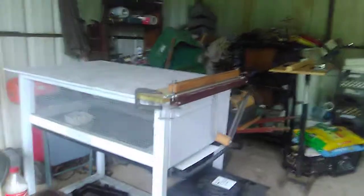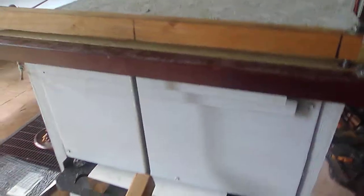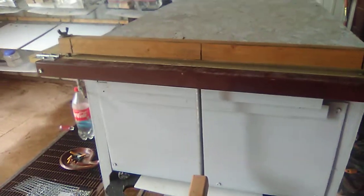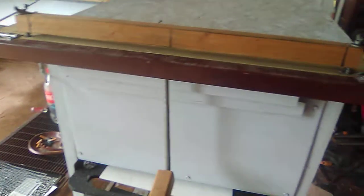This has been a time saver and it's easy to build. The hinges on this are two and a half inch — you'll need two of those. But you can make this longer. If you wanted to build one to accommodate 36-inch wire, then I would cut this piece of one by six to 40 inches, and the same on your inch and a half pieces. That way when you put your hinges on here, you put your hinges out here and you can screw them wherever you want — you've got plenty of room at the end. But I just built this one for this 24-inch wire, and it's worked great for building these cages.